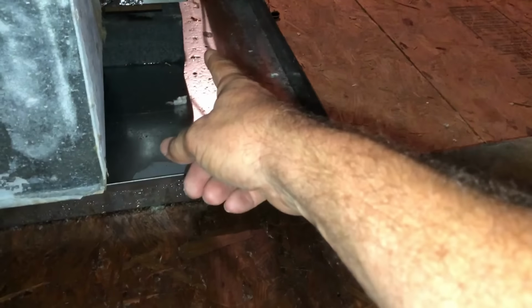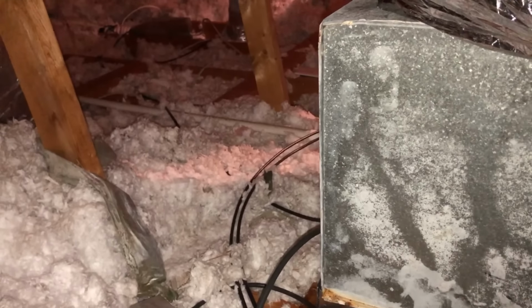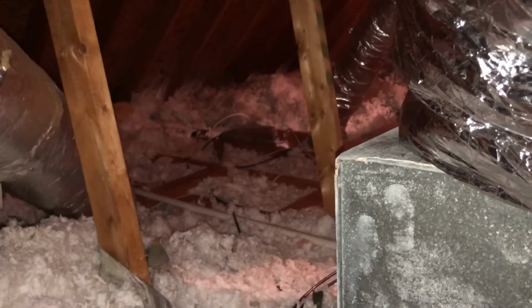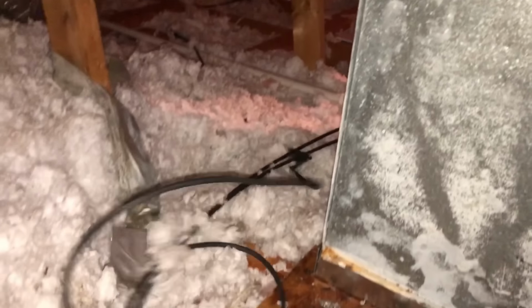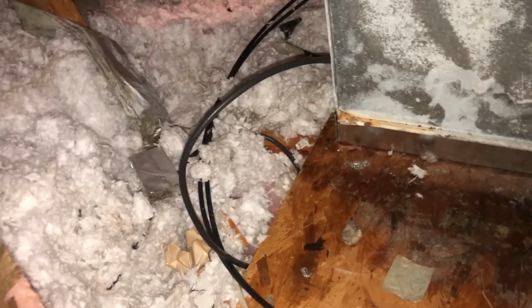So I'm gonna say those two blocks were under the original pan, lined up with those two, lifting it up off the platform. And that's why originally the secondary pipe was not running uphill like it is now. That definitely should have been seen by the installers doing the change out here, but a lot of times they're interested in getting in and getting out and just flying through the job, and this kind of stuff happens. Still a little bit worried about this corner.